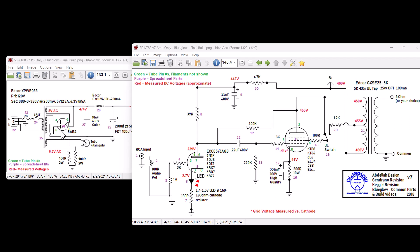Here's what I would do. First, pull all the tubes out of the unit and power it on. If you are blowing fuses at that point, I would home in on the components between the 5AR4 and the power outlet — could be a switch, a blown power transformer, or a shorted 5AR4. I'd chase that side of it.